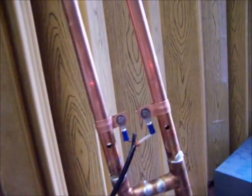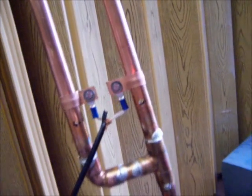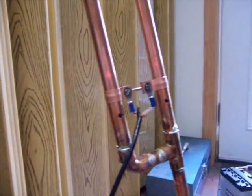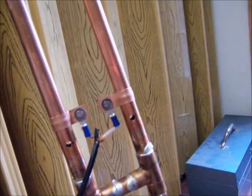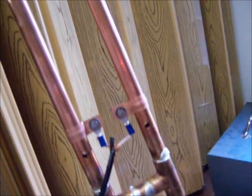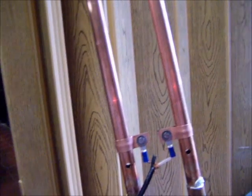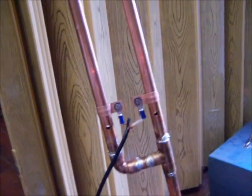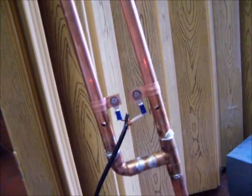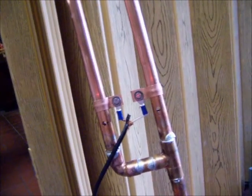This is my solution for tuning. I took careful measurements and drilled the holes where the plans indicated, but the SWR wasn't as good there as a little bit higher up. With these copper rings, you can slide it up and down and really tune it in. At about 146.5 MHz, I'm around 1.3 to 1 in that spot — about as good as I can get. When it's on the pole outside it may drop a little more.